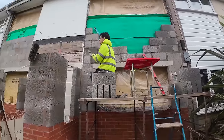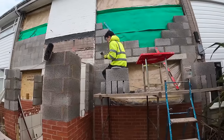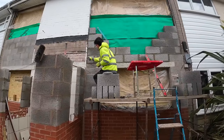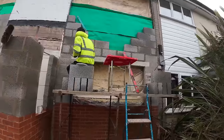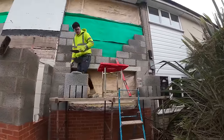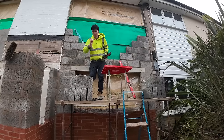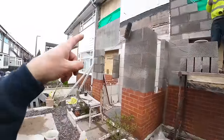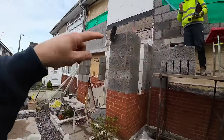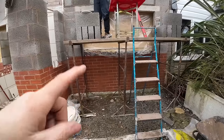So I thought if I do a corner, I can now just put my line up and put me in now. Yeah, the inside stuck out in a couple of places, same as that side, so that's all been trimmed back. Now you can just whack it in. And the thing with building corners is you are actually building block work when you're building the corner, so it's not too bad. So there's my four cuts for the top of my porch, and then that's ready for the lintel and the pike. But that'll be getting done when this lot's ready, finished with.